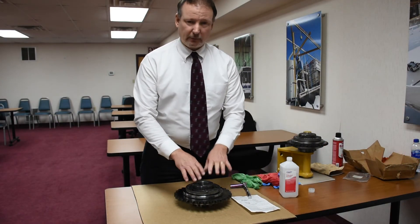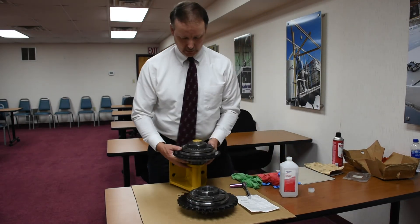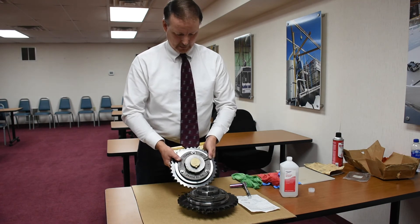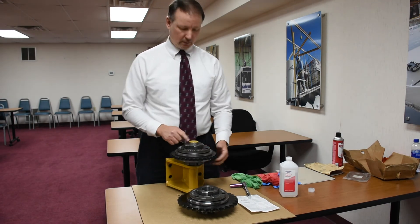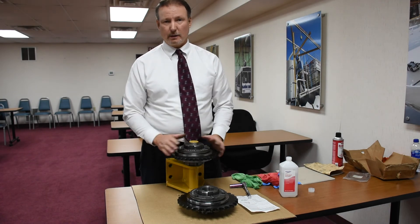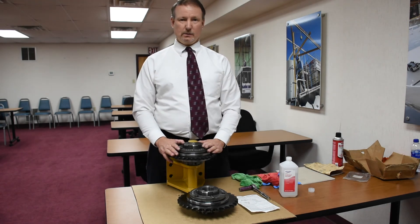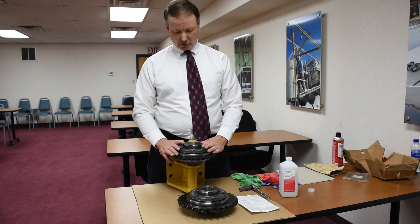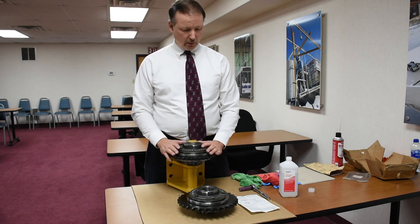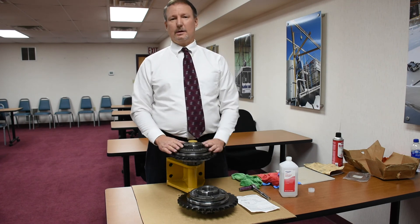This torque limiter is either going to go on the output shaft of the gearbox for a 900 series, or it could be assembled to a torque limiter mounting weldment for 300s and 301s. The key goes in the keyway, and there's a set screw that you tighten up, which locks it axially on the shaft. That is it. Thank you for joining us today. We are here to assist you with any issue with your power transmission. Generally it's the torque limiter — usually because it's been contaminated with oil or grease — and cleaning and proper resetting, making sure these bolts are tightened down all the way, should get you where you want to be.